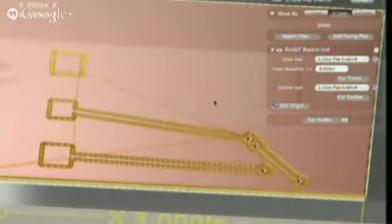And then when you change the tools, I'm assuming it needs to rehome. It'll depend. It still needs to be able to make contact with the bed at some place. If you change a tool, it's a good idea. The machine retains all its settings, so if you forget to do it, which I sometimes do because I do this all day, every day, the machine will rehome itself most of the time and save all the settings, so you don't have to touch off every single time. But it's a good idea to do it if you change a tool, just because things are never going to be exactly the height that you left them at.